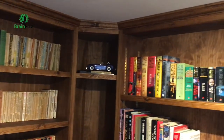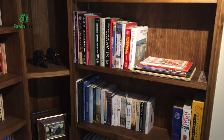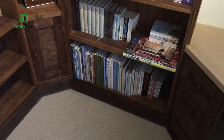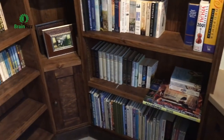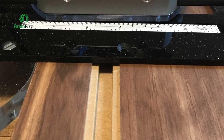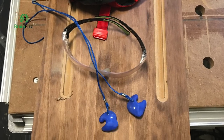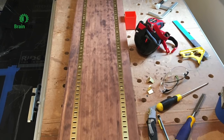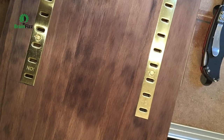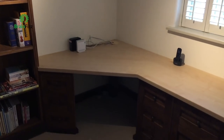The third bookcase had a few less shelves in it, but the client wanted them to be adjustable so they could move things around as needed. I decided to keep the theme of the room, which was stain with brass, so I picked up some solid brass tonk strips. They're adjustable strips — you cut a T-shaped trench in the sides of the bookcase, square off the edges, and then the brass strips get screwed into the carcass. You then have little clips that clip into that, and that makes for a very heavy-duty shelf for lots of weight.